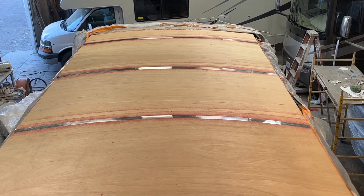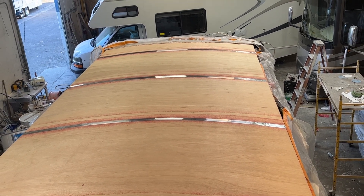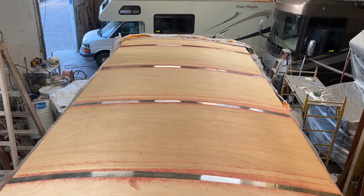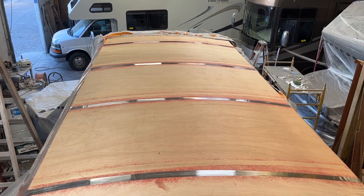The reason that we do this, why it's important, is because your original roof membrane is actually glued down to the original plywood. And when you pull that up, oftentimes you screw up the surface layer of the plywood. When you just install a new roof membrane right over the top of that, you're going to see all the flaws and ugliness of the plywood beneath.